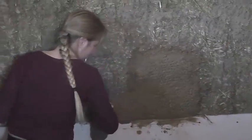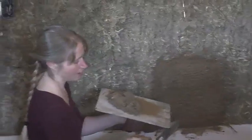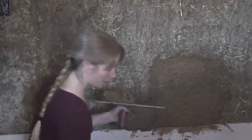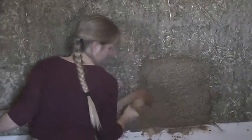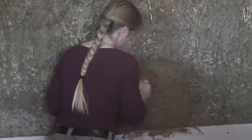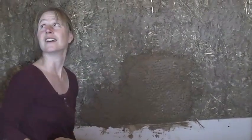This stuff is so heavy. This is more of a finished trowel and it's real soft. Some of these trowels will extend all the way and be real stiff. Actually switching to something that is stiff will allow me to work it better. This stuff is so thick that I take two hands if I'm going to try to work out some lumps. You work it like that as you're going up the wall, not all the way to the wall and then back.